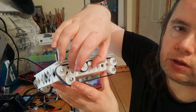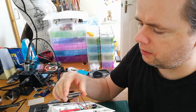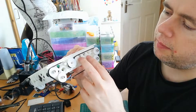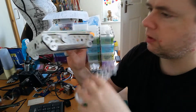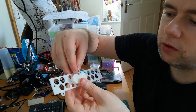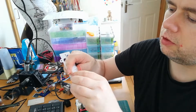I think the way to fix it is to change these idlers so they're not solidly fixed but are springy — they spring upwards while also trying to keep the track in place. I'll work on that tomorrow. It's Wednesday after work, and I've got some prints done. I was going to set it up so I could adjust a wheel to progressively make the tension stronger, but instead I decided to redesign the connection so we have the toothed gear here that pulls the belt.